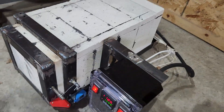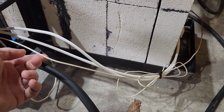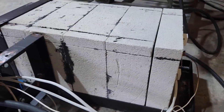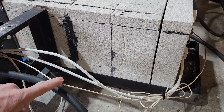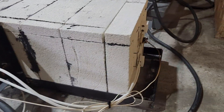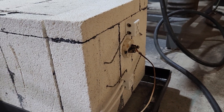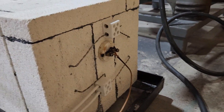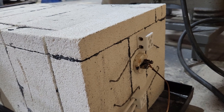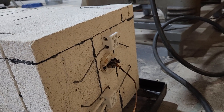A couple of other things to note when wiring these up: you have to use special thermocouple wire to connect your controller to your thermocouple — you can see mine on the back. If you just use regular wire you will not get accurate temperature values. Additionally, you can see I've got twisted wire back here for my coils — doubling up and twisting the wire lowers the resistance so the back wire won't heat up like the other stuff does.